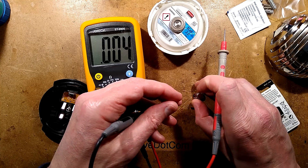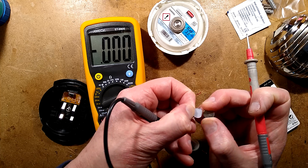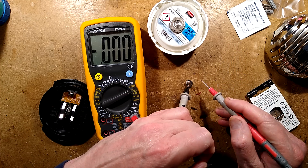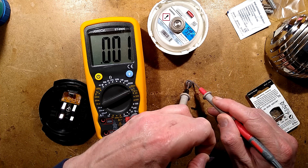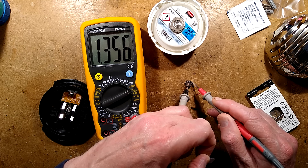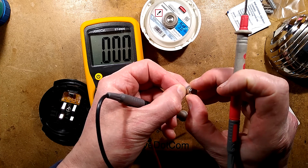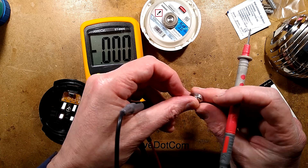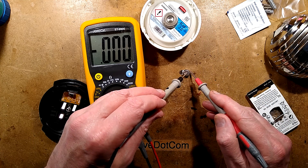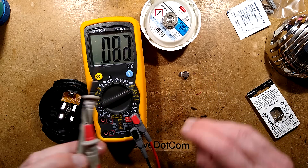Let's take the label off to let the air in and watch the voltage change. It's at 1.235 volts... now 1.34... 1.35 - it's shooting up now that it's got oxygen. And if I was to starve it of oxygen again by putting the label back on, theoretically it would use up that oxygen and revert back to its dormant state, though that may take a while and it would probably need to be loaded to do so.